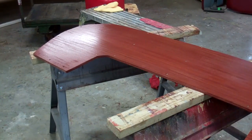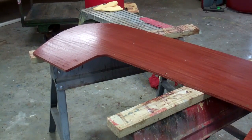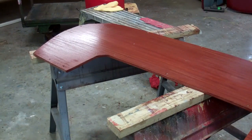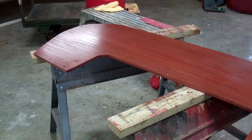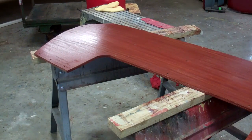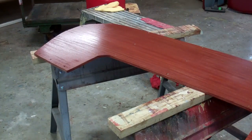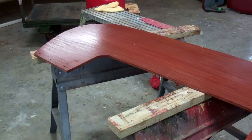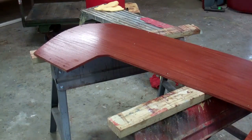And this will be the outer skin. This will be finished bright. A number of you keep asking me, do we put the CPES on the wood before we stain it? Please don't do that. You'll end up with a big blotchy puddle, because what CPES does is stop infiltration of moisture. Your stain will not be able to seep into the wood.